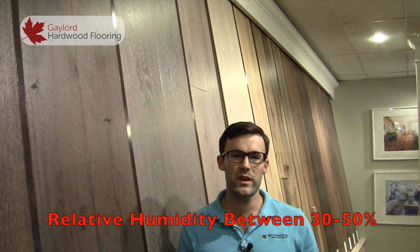The wood we used to make our hardwood flooring is kiln dried to a moisture content between 6% and 9%. This coincides with the relative humidity level between 30% and 50%, which is recommended for healthy living. The stain and finish applied at this moisture content has maximum adhesion. Within the relative humidity range between 30% and 50% the finish and wood flooring can move together. A finish must have durability and flexibility to last 40 years. It is the solid particles of titanium oxide that gives our finish its durability.